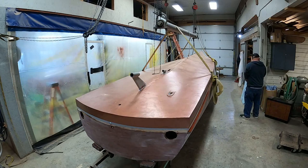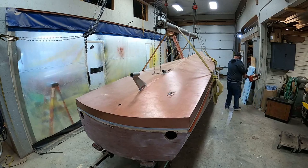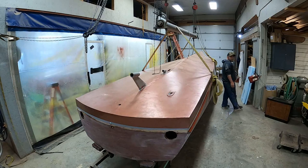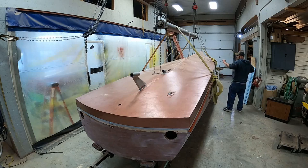Completely stripped to bare wood, stained with Mike Mayer's low boat stain, sealed with four coats of Smith's clear penetrating epoxy sealer, and then we varnished and varnished and varnished. Joe mentioned it takes a quart for two coats.